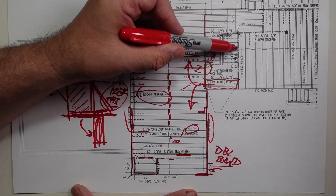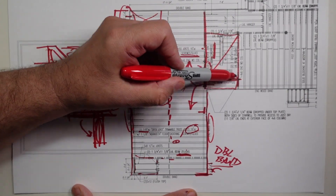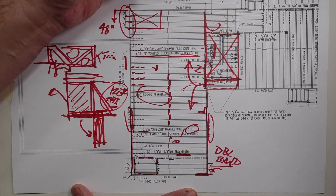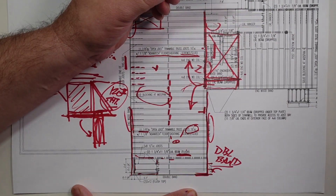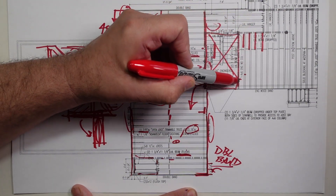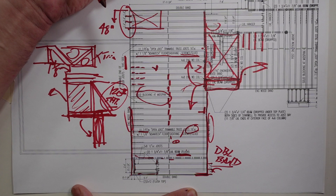There's a pretty intensive amount of LVLs happening over here, and the main reason is this is where the stair opening is. Framing continues down here — you can see we have another trimmable there. But on this side they rotate 90 degrees and fill in the rest of the framing. And notice again, we put the trimmable side up there, given that this is our mechanical chase, which gives us easy and convenient access in here.